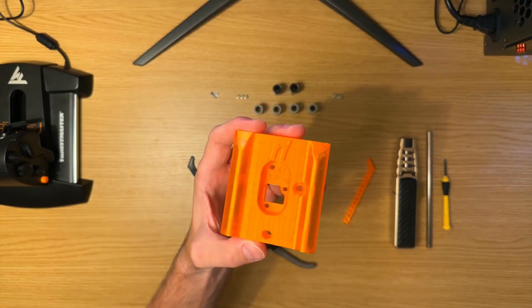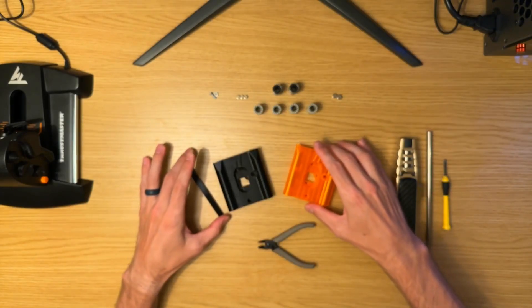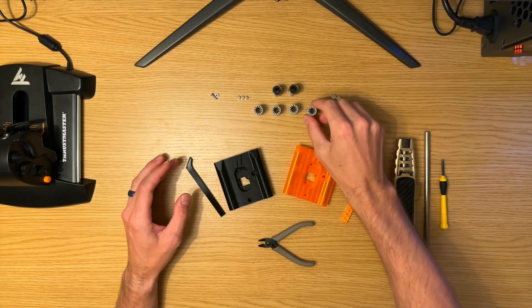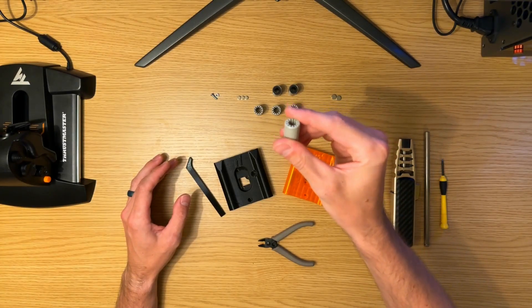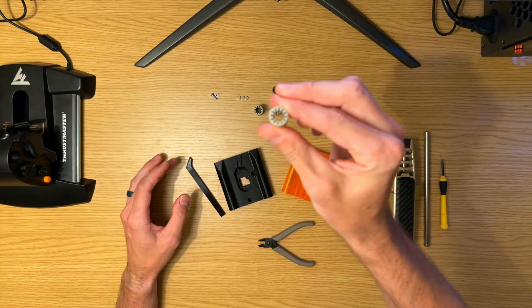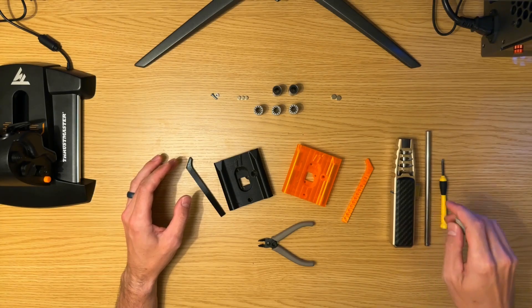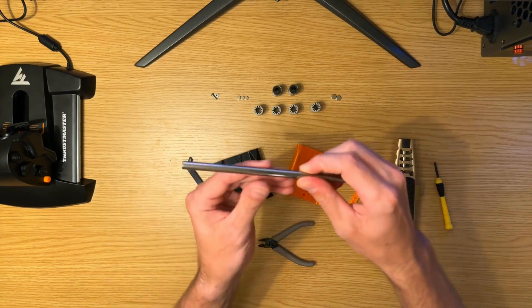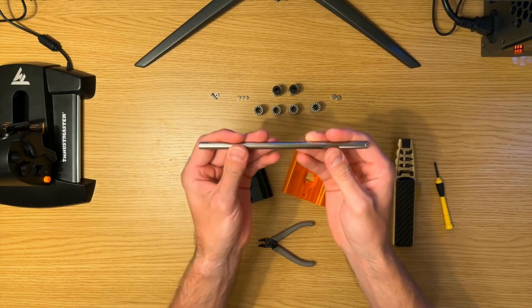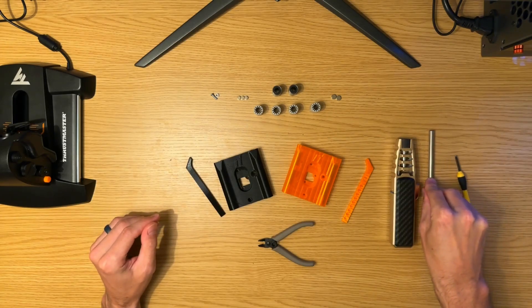The PLA doesn't work so well for me anymore. I find that the PETG doesn't thermally contract nearly as much as PLA, and it makes it a lot more easy to get the tolerance right. It's very finicky getting these in particular to work well, because if the tolerance is too tight it's going to squeeze the part ever so slightly and add friction when it slides on the rail. I always run an actual rail from a TWCS throttle to test every single slider I send out, to make sure it meets the standard of something I'd want to install in mine.